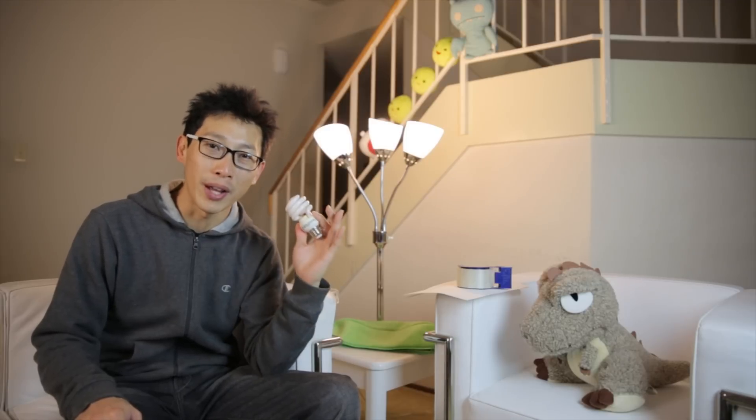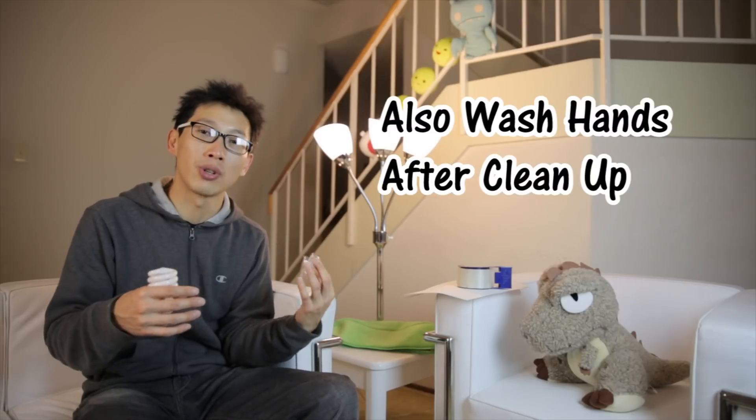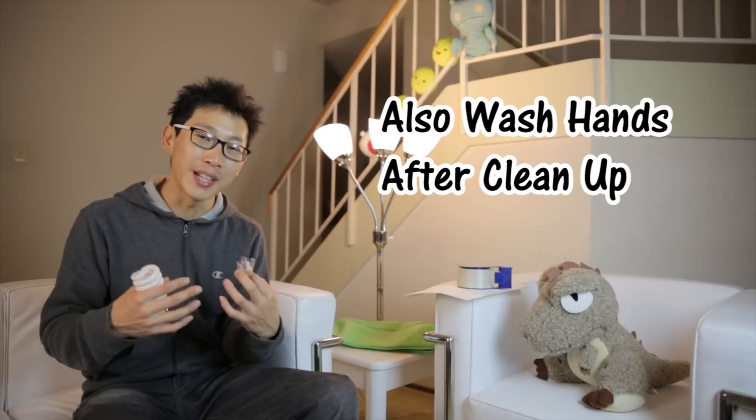All this just because of breaking one tiny little bulb, and you still have the danger of breathing in a little bit of mercury vapor. Now if you broke your CFL bulb on carpet instead of a flat surface, you do exactly the same thing. After you've done all your sweeping and sticky taping and put everything in the bag, your carpet might still have a little bit of debris. Only after you've exhausted all those other steps and removed most of the mercury, then you might be able to vacuum a little bit — and even then make sure all your windows are open.